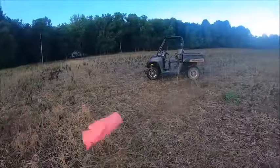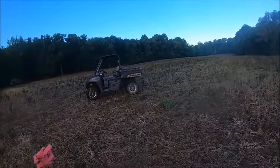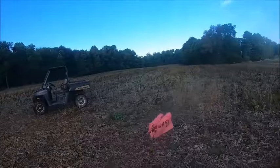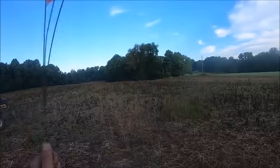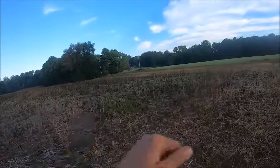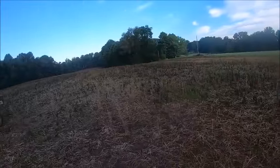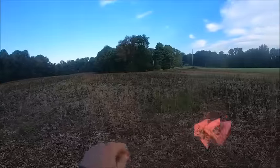Because it's going into hay, I don't want to have a bunch of land, so I'm going to plow this as a back furrow. And then these short rows over here, I will probably just plow down and deadhead back and work this off just going one way. Maybe. We'll see. Maybe I'll plow it to a dead furrow.